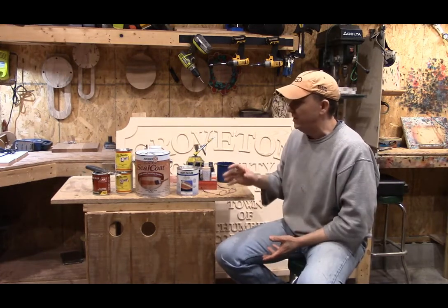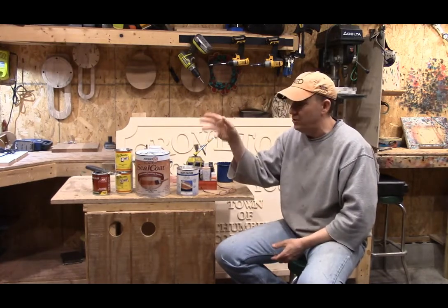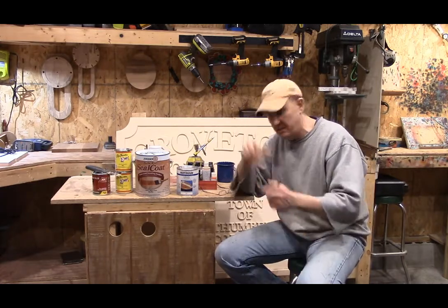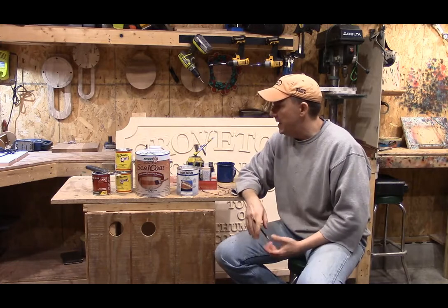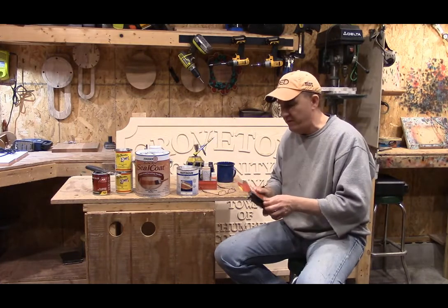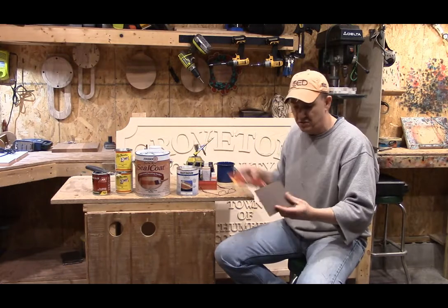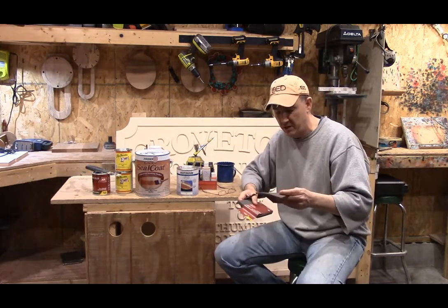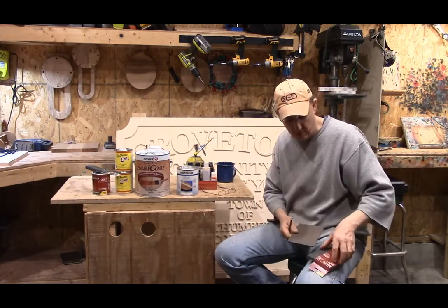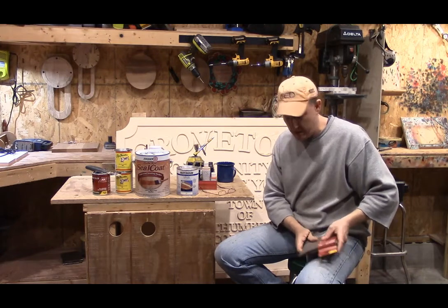As far as the sanding goes, we're using everything from a vibrating to an orbital sander. I have a small Dremel with the whip and the pen on it, so I use that as a fine detail sander. And we also utilize these small, very flexible sanding pads, and they come in multiple grits. These are really great. I enjoy these a lot. They're just a generic store brand from my local Ace Hardware, but hey, they do the job and they work just fine. All right.